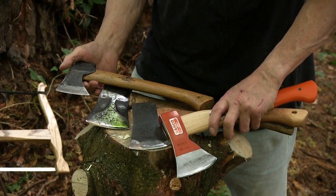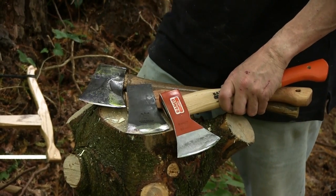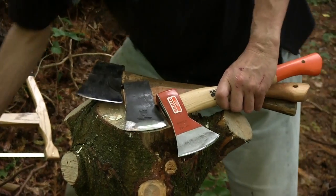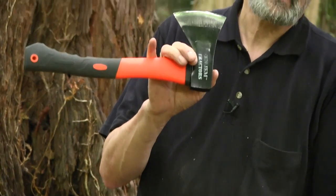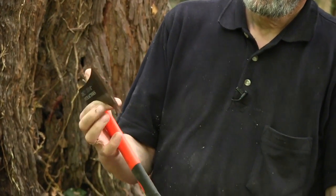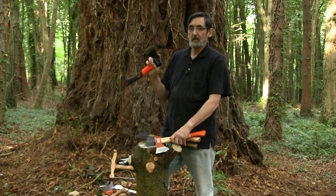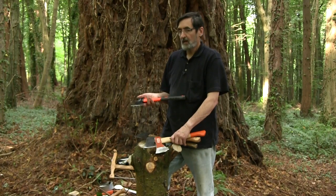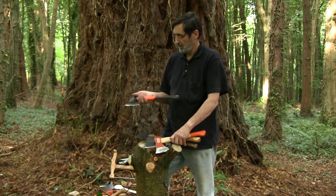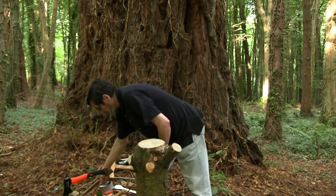You can see the heads are slightly different — this is one that I reshaped, and on my blog you'll be able to see how I reshaped that one. This is probably the cheapest one of all, only cost about five pounds, it's got a fiberglass shaft, and surprisingly the steel is excellent. I reshaped it a little bit, resharpened it, and polished the edge going through different grits using diamond plates, then polished it with a strop to get the crisp sharp edge I wanted.